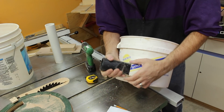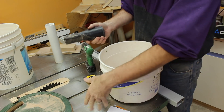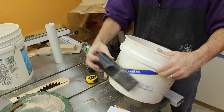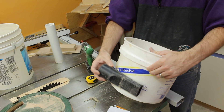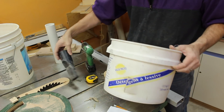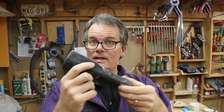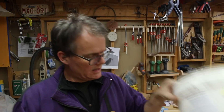The nice thing about using hot glue when I built it is I can take it apart now. So I'm going to redo this with a full diameter opening. Replacing this crevice tool as the feed into the cyclone is the most important thing, and getting a round pipe to transition to the round bucket — that's just too much work, so I'm going to use a piece of wood as a transition.